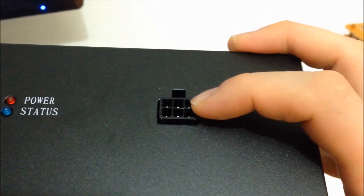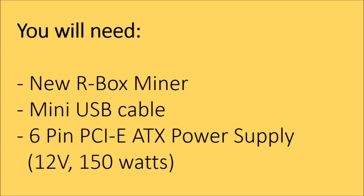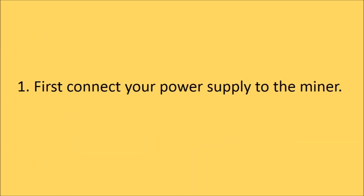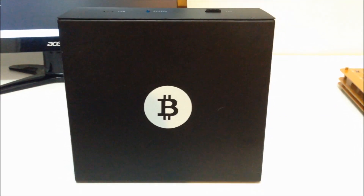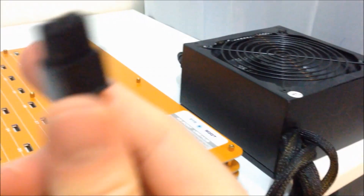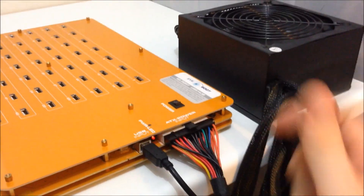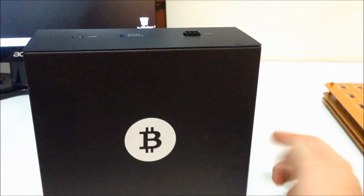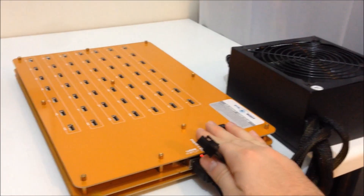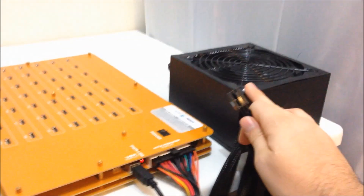It takes a mini USB and uses a 12 volt 6-pin PCI cable. It requires a 6-pin PCI cable, 12 volts and 150 watts. Today I'm just going to use my ATX power supply here, as you can see it has a 6-pin cable on it already. I use this ATX power supply to also power my USB hub — here we have a 49-port USB hub. Because the Rockminer new R-Box only uses 150 watts, I can power the hub and my miner, and even more miners, all off the one power supply.